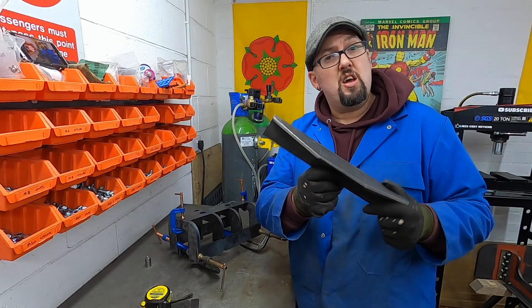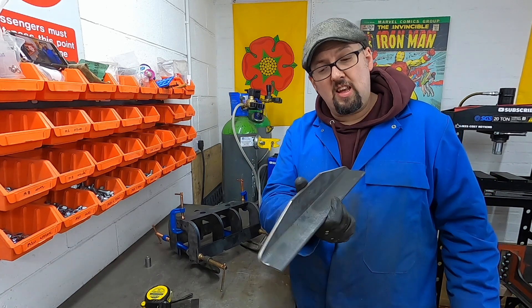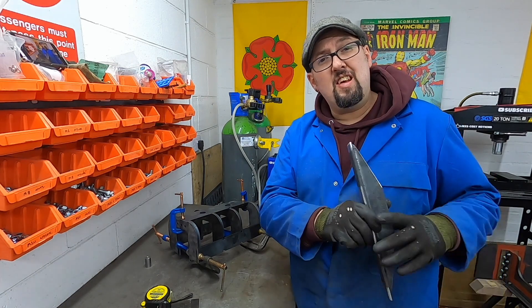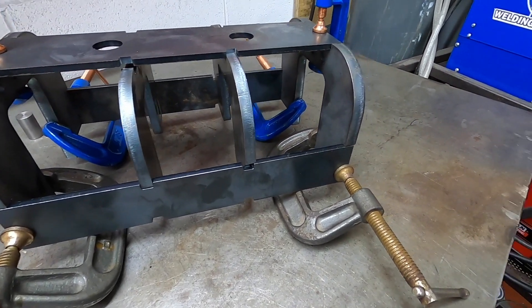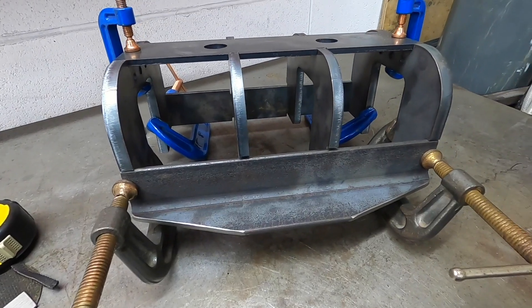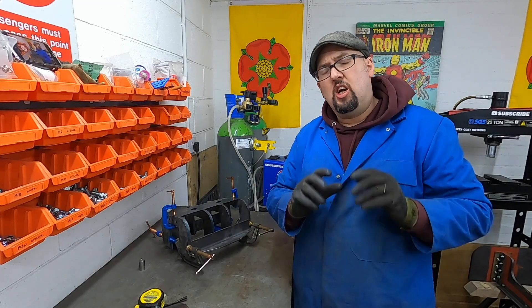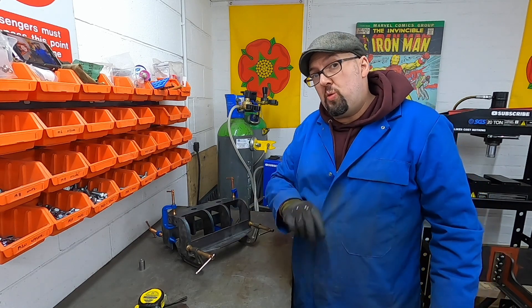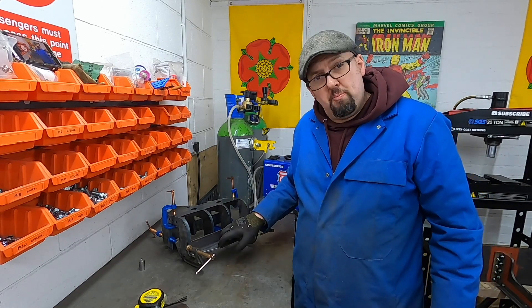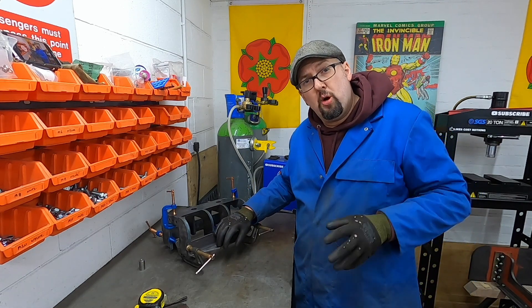This piece that you've just seen me fettling with is 50x50 angle iron by 6, and this is going to replace this to this. Why have I changed that? A couple of reasons: one, it's going to give us a little bit more rigidity, and two, it's got a decent piece of metal for me to attach the arm that goes to the pivot point on the floor of the chassis.